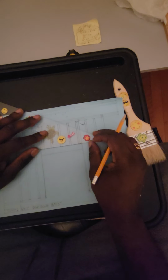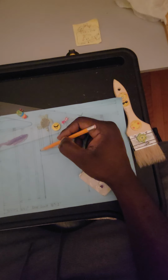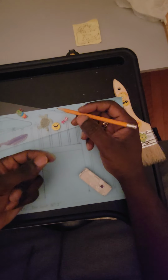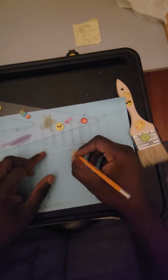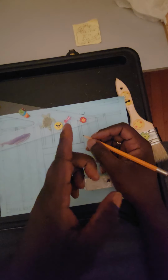Another thing that is also done in the field is that they'll put a 2x4 right on top, so they'll sandwich it. Just imagine a peanut butter and jelly sandwich, smash it together. So there's a 2x10 and a piece of 1/2-inch plywood in between. But on top of it, now you have this 1/2-inch gap, so they'll put a 2x4 to compensate for that.